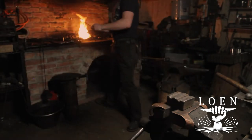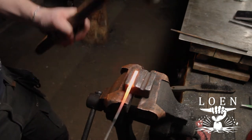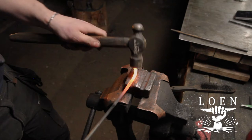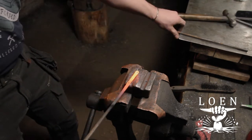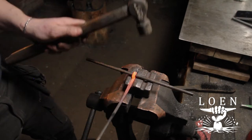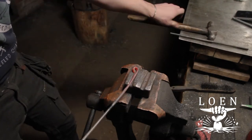In previous videos, I've mentioned how forge welding is mostly about heat and contact. To get good contact between the stem and the collar, I first forge my stick of steel into a half round using the bottom die, followed by bending it around the stem with a flat side end, then cutting it off while leaving a little gap, fluxing, and moving on to the forge welding heat.